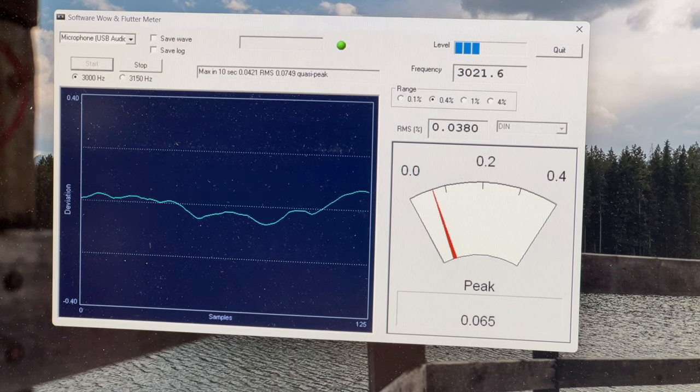So let's get started. I've got the scope up and running. We're going to use the measurement function of the scope in order to dial this in. See if I can actually get you in on the scope here. Well, maybe it's best if I zoom out so you can see me adjusting in real time. That should do the job. Okay, I'm going to power up. I am on the tape position, and where's my adjustment thing I just had? Okay, NE650, 549 millivolts. That's what we're looking for. So I'm going to do both channels at the same time. So let's go ahead and do this.